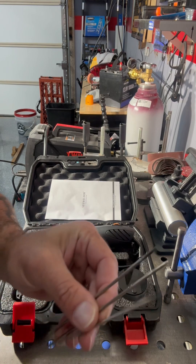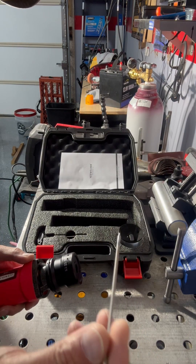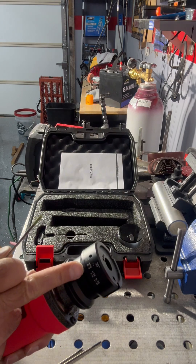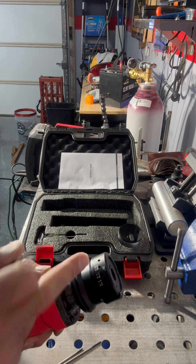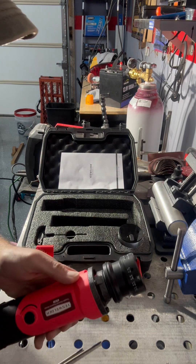Let's get this fixed, guys. I'm going to use a 3/32" tungsten and we're going to use the 30-degree setting, which you can see right there. You got the 3/32" mark — you put that in there and then you just turn this on.